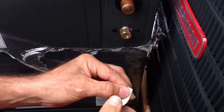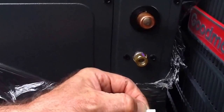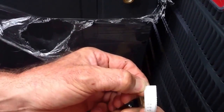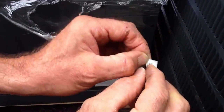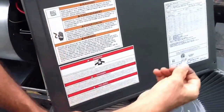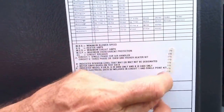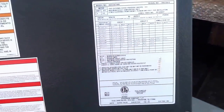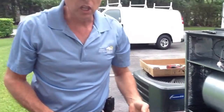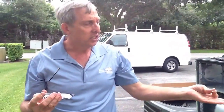Notice how I've got a little sticker here — we're going to put the sticker on the door up here. That sticker will tell me that this piston in here is a 70. So I'm just going to peel it off and put it right here on the platform. That way, if anybody ever comes out here to look at it — if they think they might have a piston problem or too much liquid getting back to the compressor — they're going to see that it was changed; that's not the case. It may be another situation.